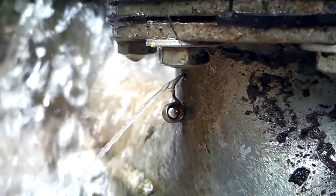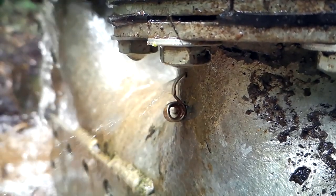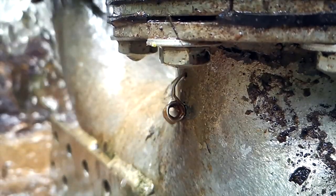Another way of introducing air into my pressure chamber is I use what's called a snifter valve. The snifter valve is this little hole that you drill just underneath the one-way valve that takes you into your pressure chamber. That allows you to get a little suction of air in between each cycle. That air gets into your chamber — it's the compressible section of your system which allows you to drive this water up the hill.